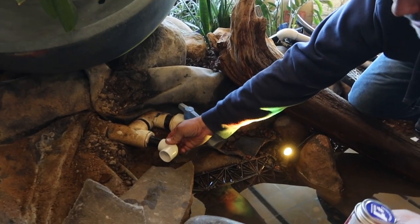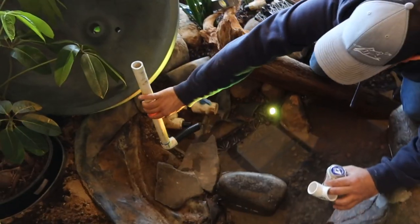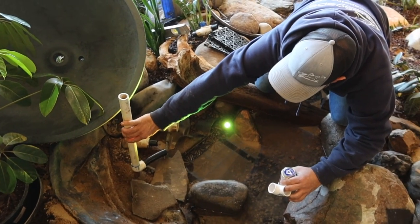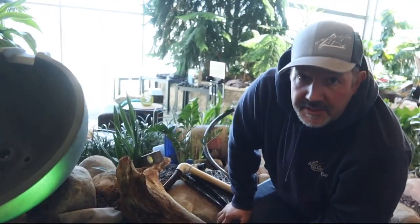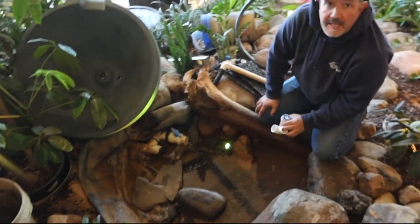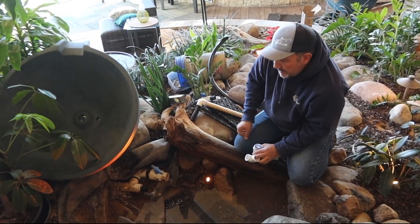We'll remove the existing plumbing, cut that out. We're going to put an elbow here, a small piece of pipe going there, and then reconnect it with the original PVC pipe that they have going up, and then trim this to the right height. That's pretty much the last step for the plumbing, and then we'll obviously do some adjustments with this valve, and also we have a 2 to 4 Aqua Surge pump in there, so we'll be able to do the adjustments on that. All right.